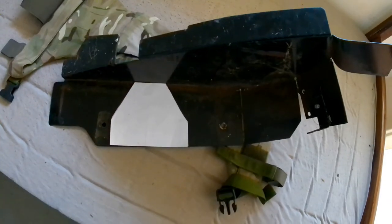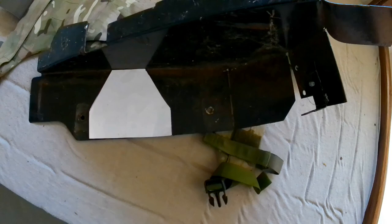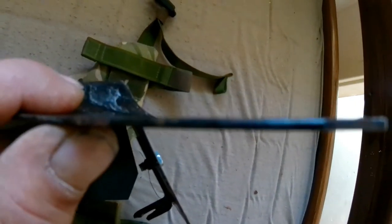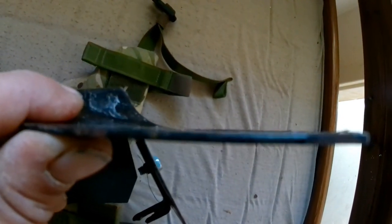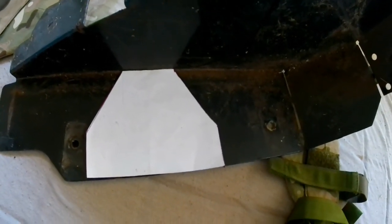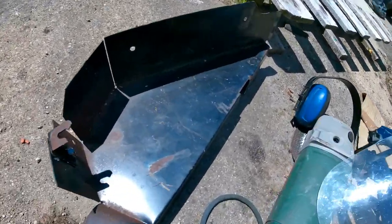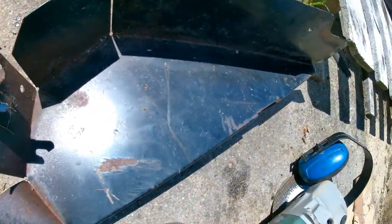For the next step I use a solid steel core. This is in no way required and can be substituted with more layers of fiberglass mat. However, I find it quite convenient to work with and generate the general form with a steel core. For this purpose I use 2 mm of rolled steel. I will be using this angle grinder and of course the appropriate security measures to cut the plates out of this.